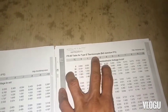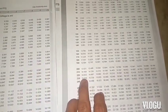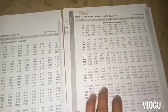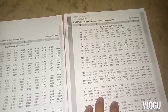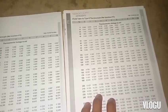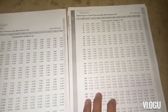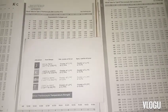Here is type E. This is the thermocouple type I think I'm testing, because at 15.3 millivolts it's almost the same as generator number three that works normally. We consider the thermocouple is good, and the type is E — because this is nearest to 220 plus degrees. The others are too high.